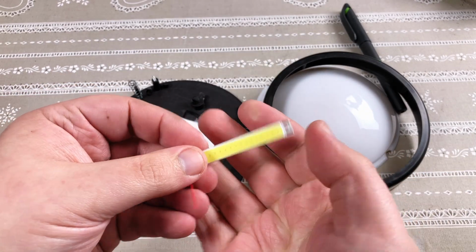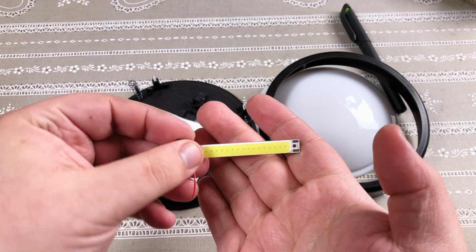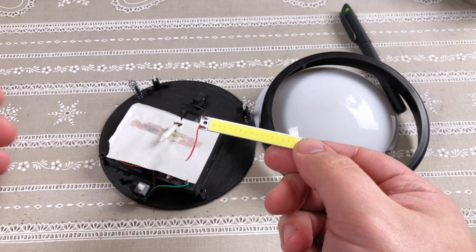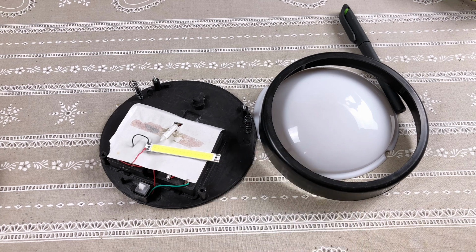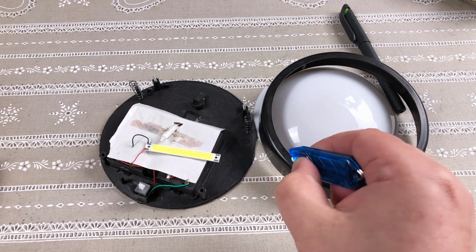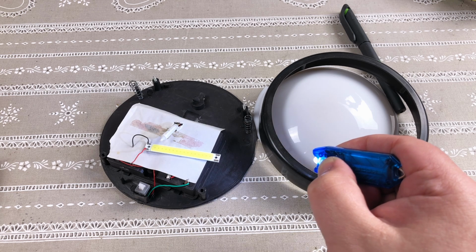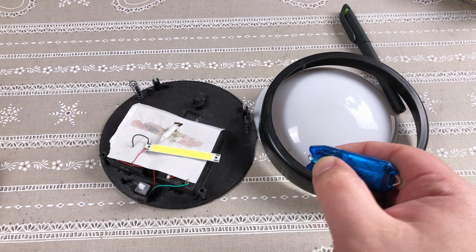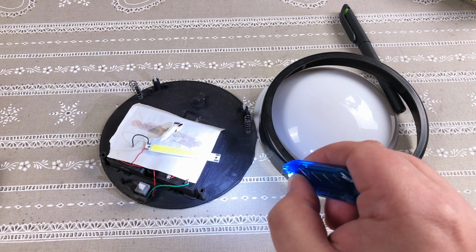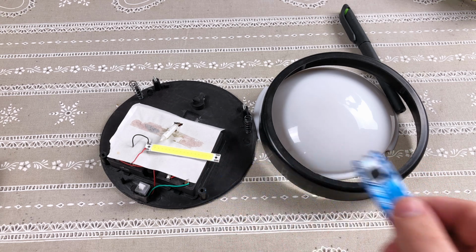This is, I think, 3 watt nominal power, 900 milliamps at 3.3 volts. That is plenty bright for my need, and I'm implementing a dimming function similar to one found in these flashlights. Single tap to turn it on at low brightness, double tap for full brightness, or long press to select any brightness by holding until desired brightness is achieved. This flashlight actually has long press to turn the LED on at full brightness until the button is released, but that's not needed in this type of light, so I'll use that for adjustable brightness instead.